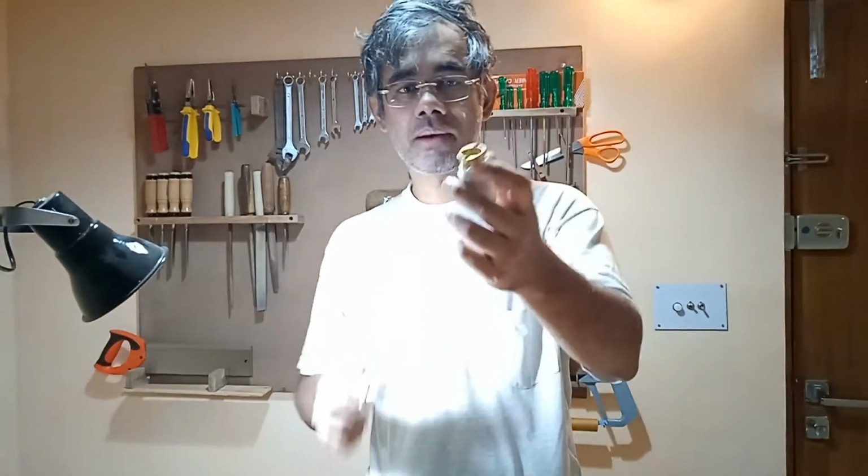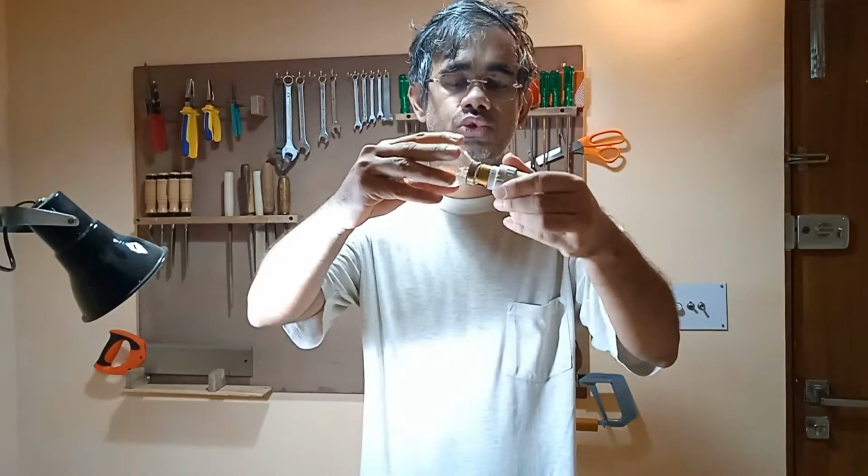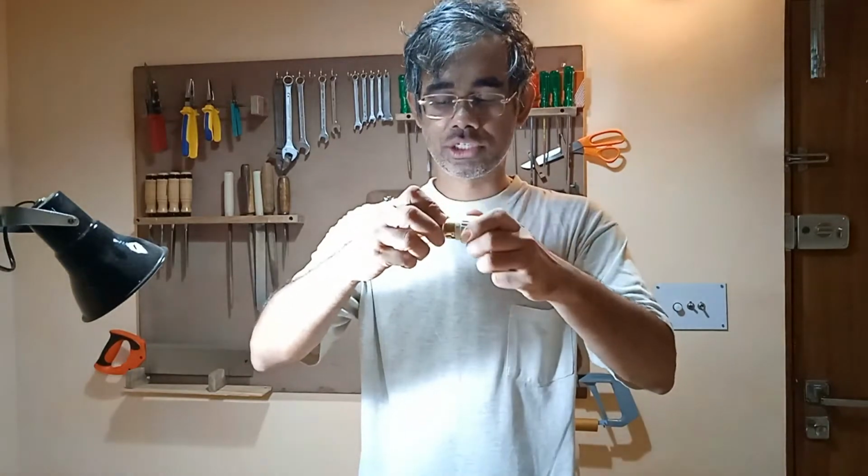So yeah, the wires, and you also need holders for your bulbs. Again, you have to ensure that they come in the matching style. So again, these are B22. You got to ensure that they are compatible with each other, and these holders are really cool. They are pendant holders, so the wire goes into them and you can hang those. That's very important.